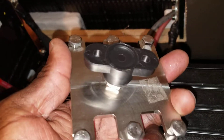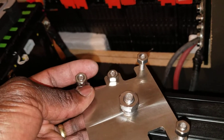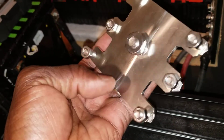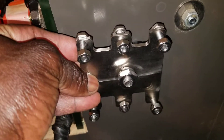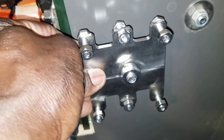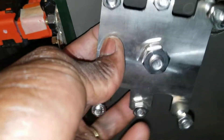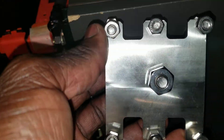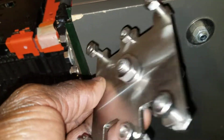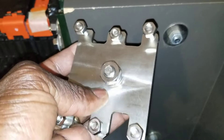I'm not saying I was copying — I just wanted to make something similar to that midnight bus bar. It's very expensive, approximately 50 to 60 bucks for the midnight one. That's why I decided to create something like this to improvise — this is like a bus bar, exactly. It's going to be mounted just like that on the wall. Each bolt and nut here is going to get into a battery string, and the main stem here is where I'm going to put my inverter wire — that big one right at the center, holding it, so all the strings get tied into this. These are stainless steel bolts and nuts — this is a beefy bus bar. See how thick it is? I decided to improvise and make mine. Stay tuned, like and subscribe — JW Solo USA.